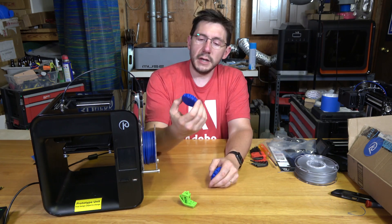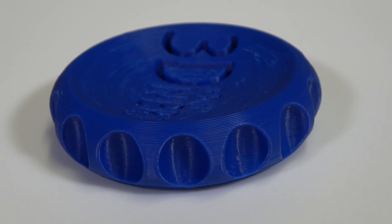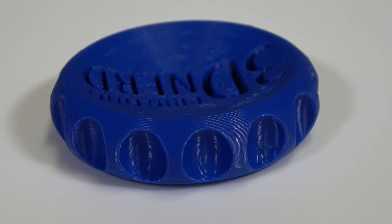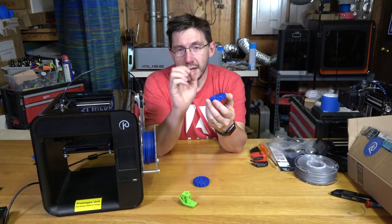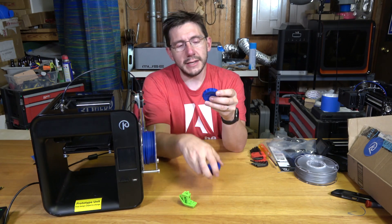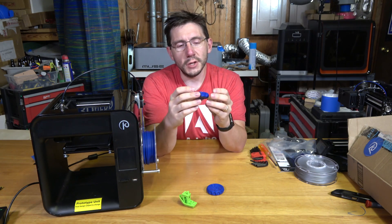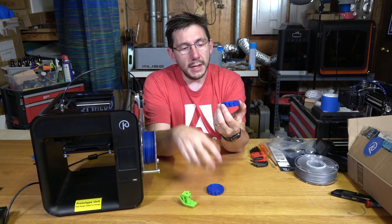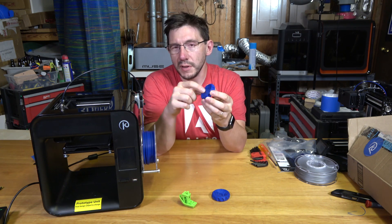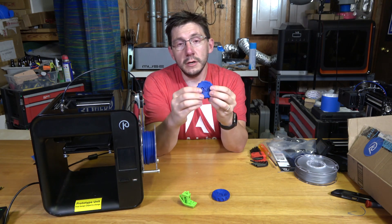Michael had a plane to catch, so I started my MakerCoin as he was leaving. I didn't have the settings quite right — I used 60 millimeters per second for the print speed, which was a little fast for this machine because the infill in Cura was automatically set to something crazy like 100 millimeters per second. Even with non-optimal settings, this was able to print really well — the MakerCoin looks really good. I re-sliced it, set the print speed to 45 millimeters per second, and Cura automatically adjusted the rest. There's a little bit of pillowing from low infill, but the letters are accurate and the sides look good.